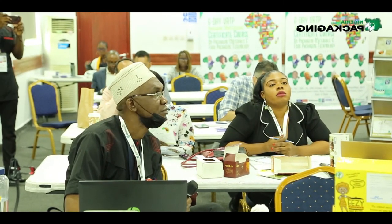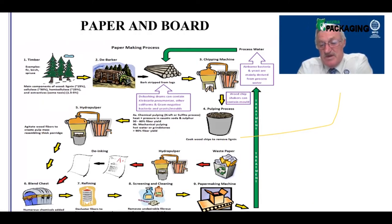So just in a nutshell — we all know that paper comes from trees. The logs are taken to the mill where they pulp it. They first make it into chips, then it goes through various processes, either chemical or mechanical or both, and ultimately ends up on a Fourdrinier machine. It comes out on a screen through a process of calendering, where excess moisture is squeezed out, and a coating process fills up any valleys and crevices in the paper, resulting in the finished product like the paper on your desk.